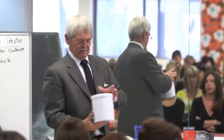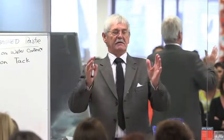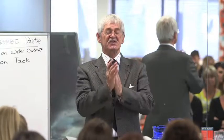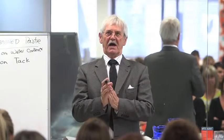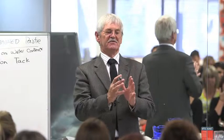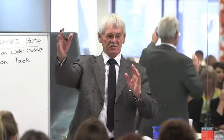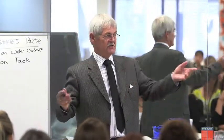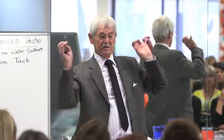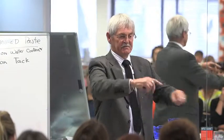Can I just ask, that's only when the glue's curing, is that right? Yes, that can happen. Joins can open, caused by other problems than heat, but heat will open them first. And even the sun. I've seen guys, new house, they've papered the walls, they've gone home, and in Christchurch on the hill, for example, round about 5 o'clock it gets 10 times hotter, and the sun just coming in through the windows cooks the wallpaper. So all they had to do was put sheets up on the windows, stop the heat.